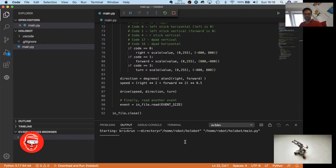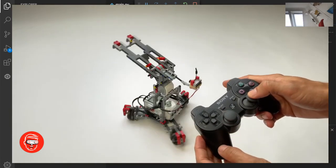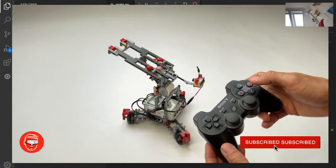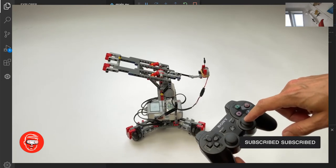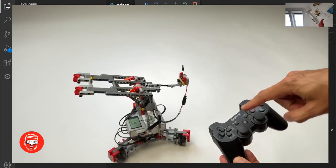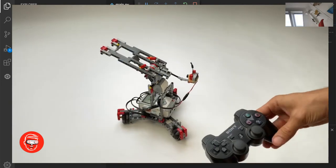So, I have to show the model. Maybe now you can see it clearly that it rotates the wrong way. So the next two things we're going to program are a dead zone, so when I release the sticks and they are almost zero, the robot will get real zeros, and we will invert this number. Okay, let's get to it.